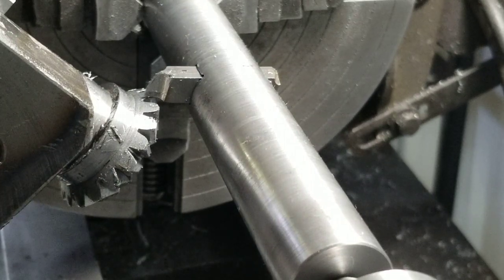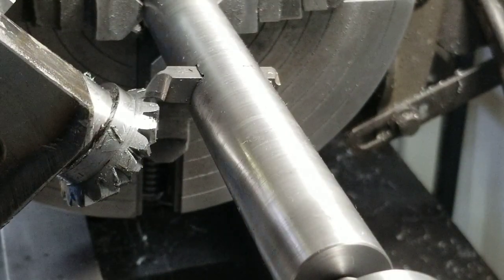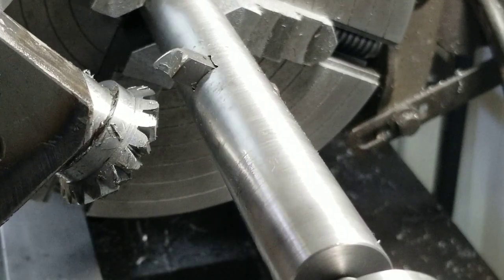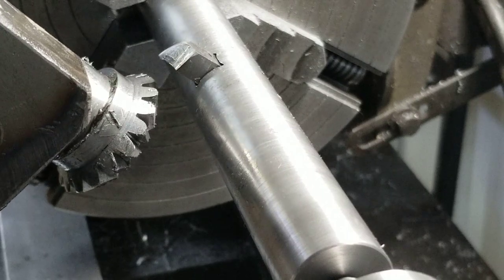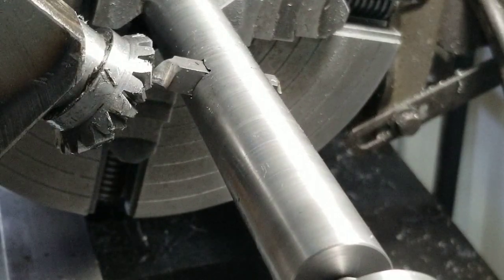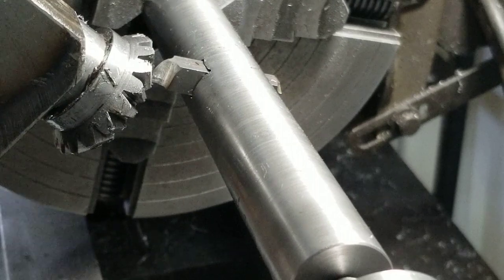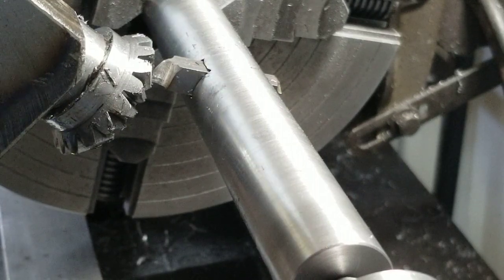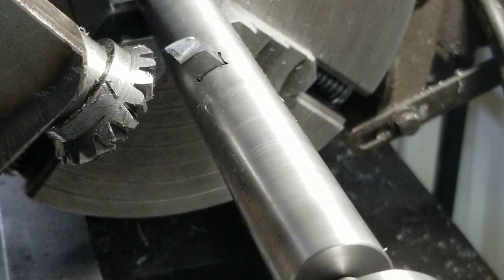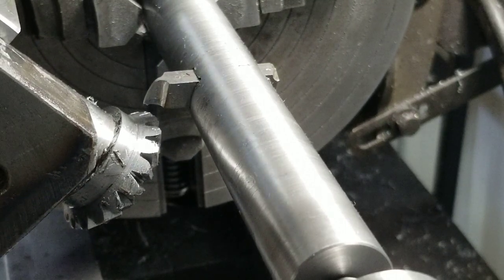And holy crap, cross our fingers, I guess. It looks like we might actually leave a little bit of a shelf in the middle there because the tooth cutter is a little bit small, but that actually looks a little better. And I could very well have this totally way out to lunch too. Don't get me wrong. That actually looks better right there. Yep. I actually took it another 5 thou over. So like I said, I don't want to take too much of the front of the tooth off, mostly just on the back side here.